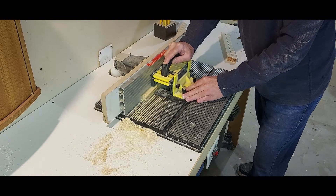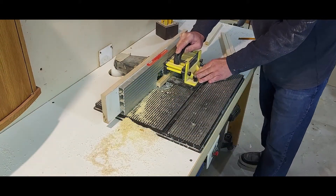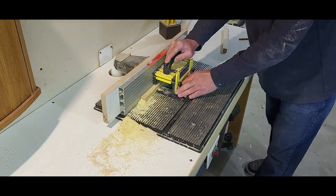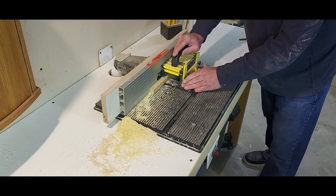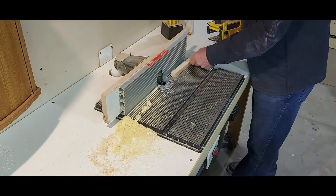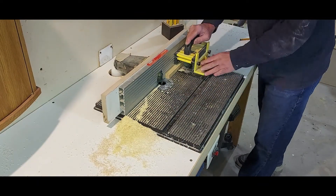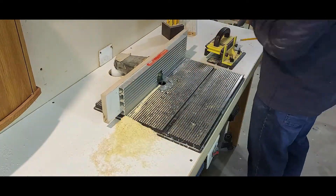Originally I said I was going to do this on the table saw, but it occurred to me it would just be a lot easier to do it on the router table with a quarter-inch router bit. Yes, we're going to see the dado on the rails, but that's okay — I'm going to just fill that in with a little piece of wood, because for this effort I don't feel like doing a stop dado. That little tool is called the Gripper. If you find one, buy it — it's really good for doing things like this with smaller pieces. It holds it to the fence and holds it down, so it's a great little tool.